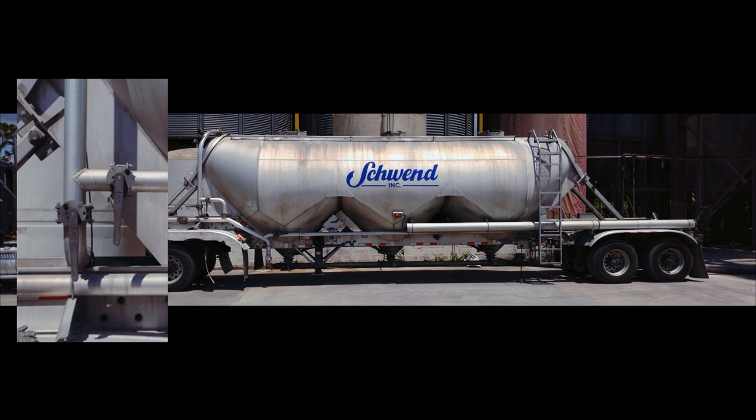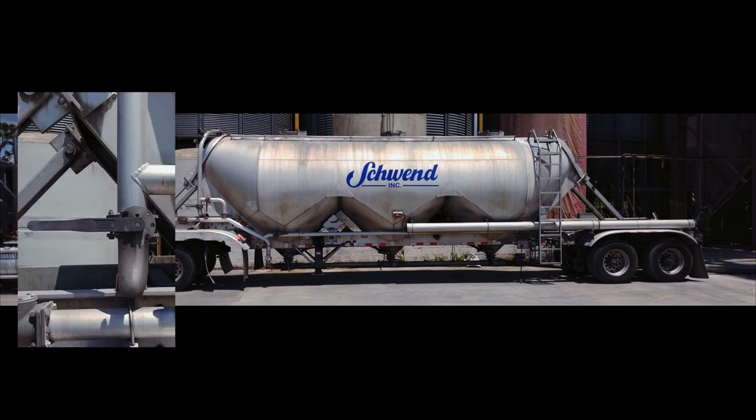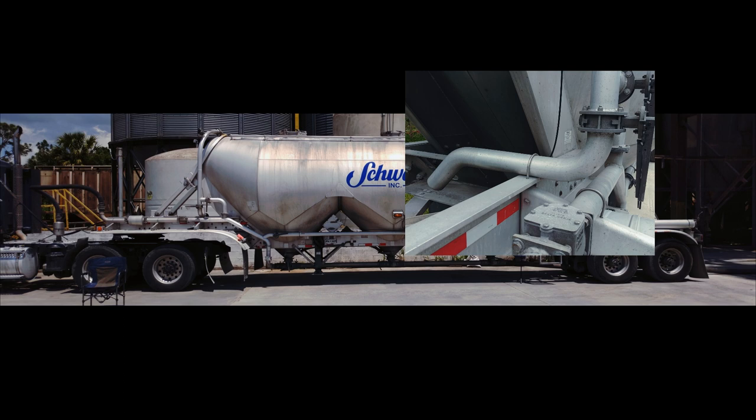I usually leave it open when driving with a fine or coarse heavier type load. You may get a little pressure build up when it is closed. Now, if I'm doing a lighter powder dusty type load, I would close it while driving. Because the trailer is filled to the top and the load is more spread out, if you have to get on the brakes a little hard, the powder dust could slide forward and some may exhaust out the relief pipe if the valve is open.